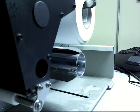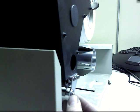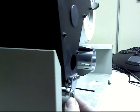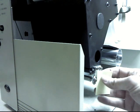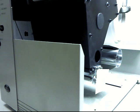Now, on the back side, this is where an automotive feeler gauge or something like that would be handy. Over here, on this end, where you've got the little clip, you want there to be a half a millimeter of side-to-side play, so you're not torquing down that pulley too tight so that there'll be resistance when it spins. So just about a half millimeter out is where you want it. You can see I've improvised a feeler gauge here made of sticky notes that are a half millimeter wide. So I'm just going to stick it here and use that as my spacer. Might have to use a little tape to hold it in place. And then on the other end, tighten the pulley down.